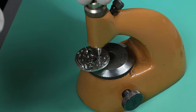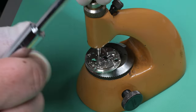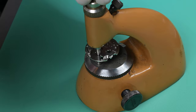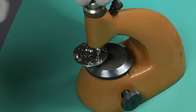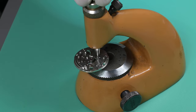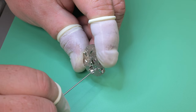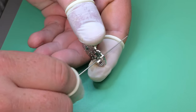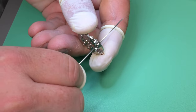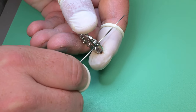In my staking set I have domed upper and lower punches, and what we're going to do is slightly hammer on this plate and shrink that hole down a little bit. I apologize for the camera shake — it's just a result of how I have the camera mounted on the desk and the vibration of hammering on that staking set. We're going to close up that arbor port and open it back up slowly with a smoothing broach, working it a little bit at a time. This hardens that steel inside the arbor port, and I do this three or four times before I get the fit with the barrel arbor that I'm looking for.